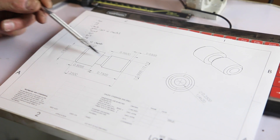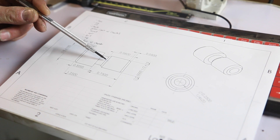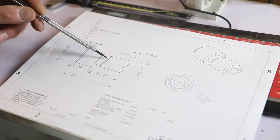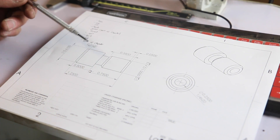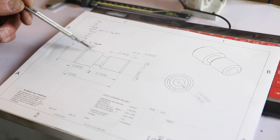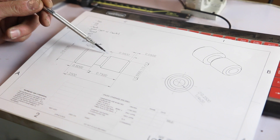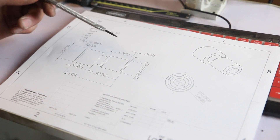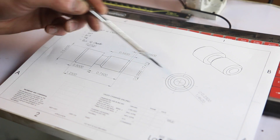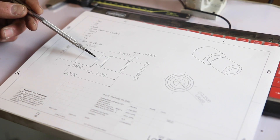Here's what we want to do. We want a piece of steel that'll be 1.25 inches long in the end. We're going to take the first length at 0.580 inches and thread that half-13 with chamfers on both sides. We'll turn the backside down to 0.610 from a starting diameter of 0.625 or 5/8 inch. We'll do a groove for thread relief, and then on the center we'll spot drill and tap for quarter-20.